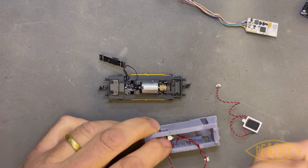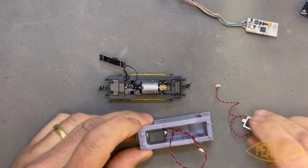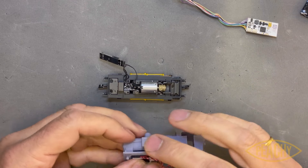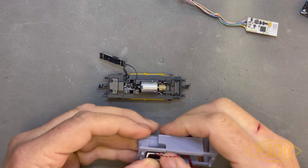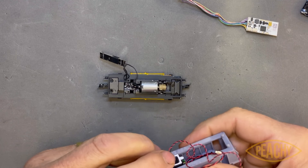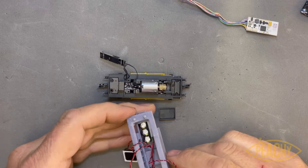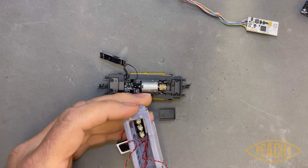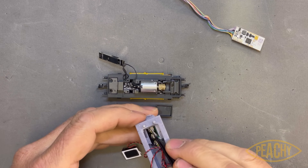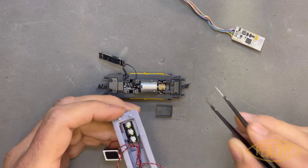Where's the sugar cube and mounting sandwich? Let's see if that goes in. There's the sound box — the speaker will be facing down. It looks like we need to find an extra millimeter or two. I think there's some material that can come off the inside of the bottom of the boiler — we can take a little bit off both sides, that loses about a mil. Then perhaps we can take a little bit out of the actual sound box itself — it's quite thick so we might be able to remove some from there.